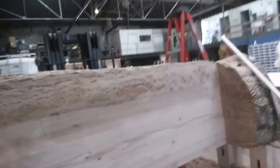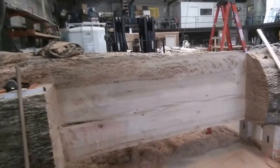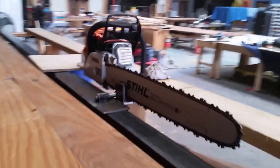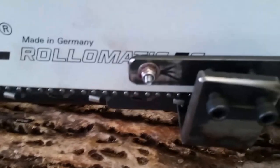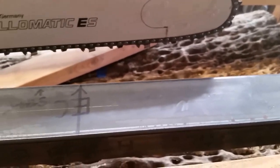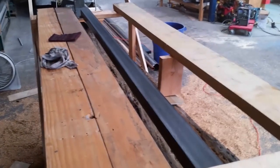I made an Alaskan sawmill as well and I'll show you some still pictures when this whole thing's done. I made this modified bar — I bolted on this piece of quarter inch plate through the bar and then I made this pivot point that's attached to this sled which goes over this two inch by four inch piece of tube steel and it will ride this track hopefully.